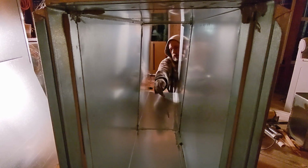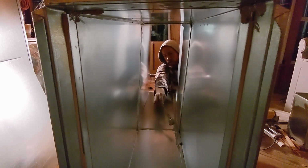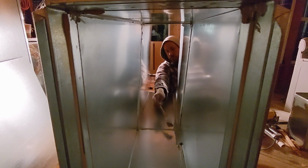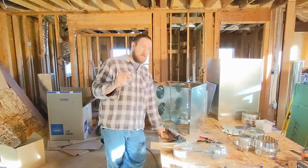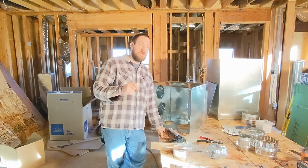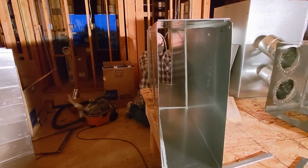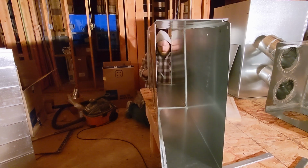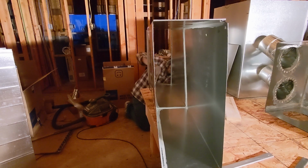And maybe this is something where I had misunderstood, but at the prior two houses that we've remodeled, both times we've had a professional contractor, different contractors, come in, replace the main unit, and some of the immediately adjacent HVAC, mostly metal, because I didn't want to have to work that much with metal. This is newer to me, and I've mostly dealt with flex duct in the past. When I went back on the first job, I had to rip something that they had done out, and there was no mastic. And I'm pretty confident, and this is years ago now, mind you, so it's on me, but I'm pretty confident that HVAC installer had told me he didn't really believe in using mastic. He didn't feel it was as good as the newer tapes. Mea culpa, I did not do my own research on this.